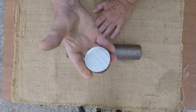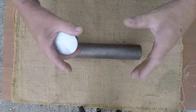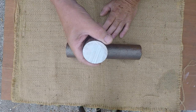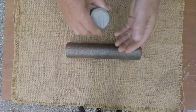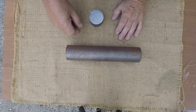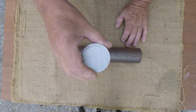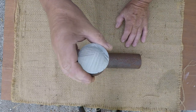What they would do is take this stuff, and of course they had large rounds of it. This just happened to be the stuff that Don got, but they would forge die molds for body parts. If you're going to shape a car door out of steel, it's pressed. A male and a female form would go together, and it would press the sheet metal or whatever other car parts between them to create their desired shape. As time went on, Don even talked to the guy who was in charge of using this stuff, the metallurgist that is making the dies, and the machinist.